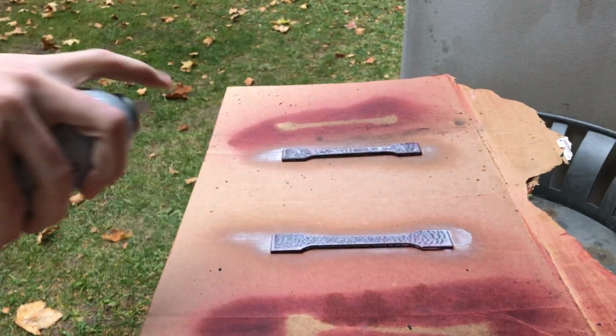After another 15 minutes, we placed the specimens under the microscope and went looking for cracks. All of these cracks were caused by the thermal shock induced on the specimen earlier. It is rather incredible how just going from hot to cold rapidly greatly affects the structure of the metal.